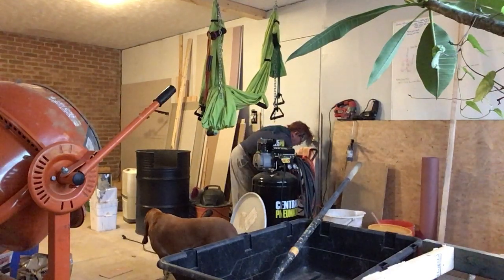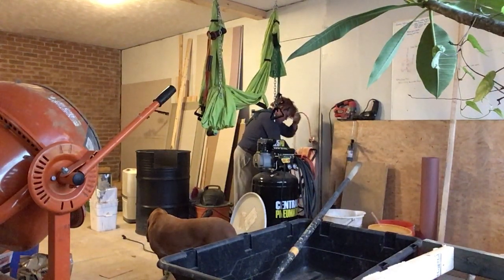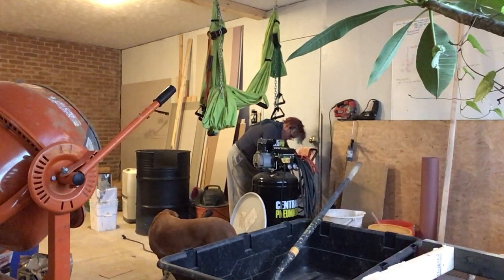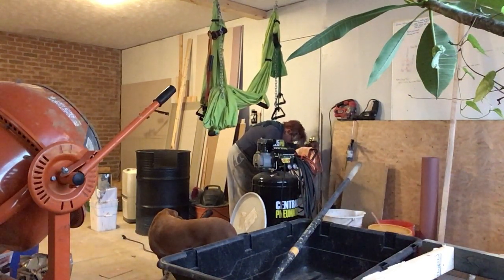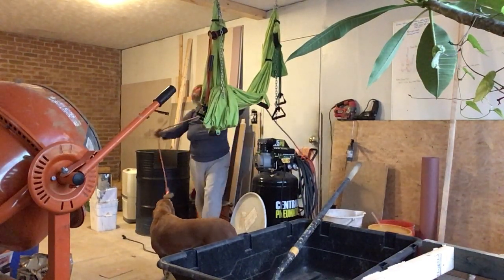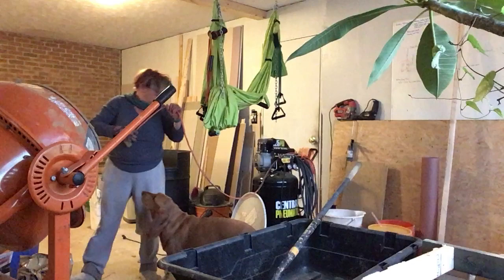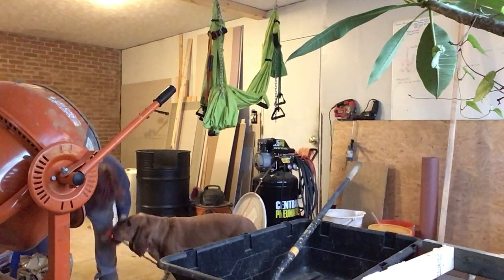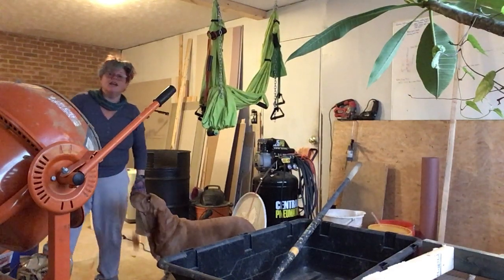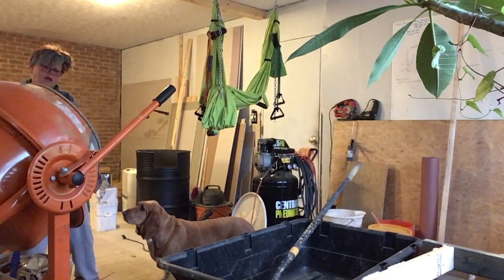The stove really just provides the input into the water. It doesn't have any significant storage built in. You can definitely heat large amounts of water if you need large amounts of hot water, but you need much larger storage than you have in that small boiler, for people who have larger needs.